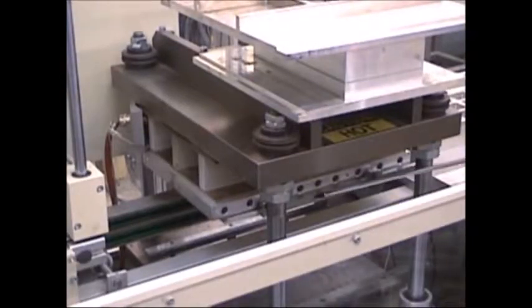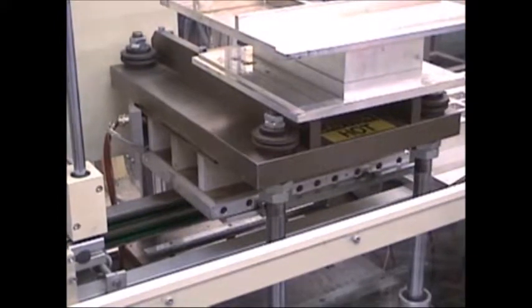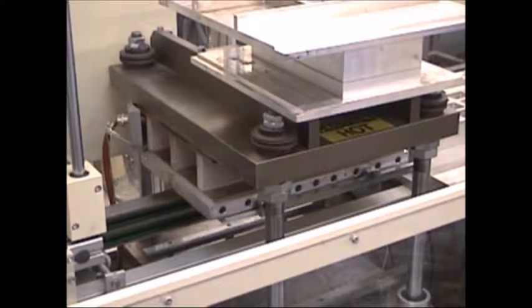This is the foil sealing station. Again, you can see it a little better down here. You can see the track where the plate slides in, and you'd have your bottom box underneath there that would come up, and this part will go down and seal. This is also a servo operated toggle, so your pressure is very good. There's no need to worry about that. It's not sealed.